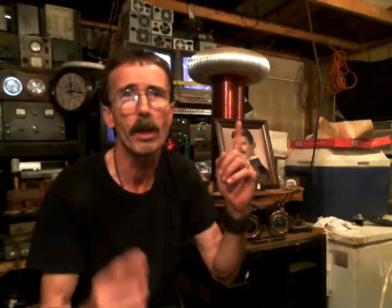The question was whether or not you could actually get enough working energy out of the dirt in order to actually do something. When I made my first ground rod — my copper-coated ground rod and my galvanized ground rod — I was getting approximately 0.71 to 0.80 volts out of it while it was under a load.